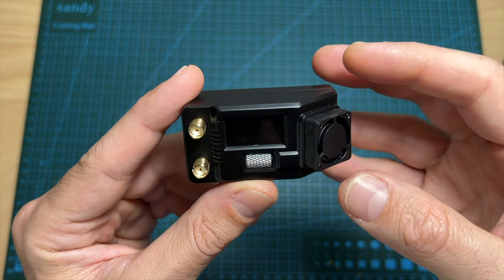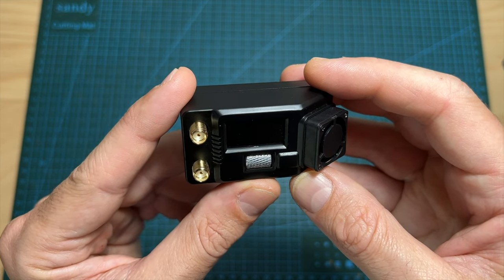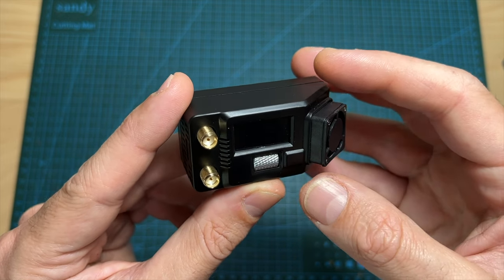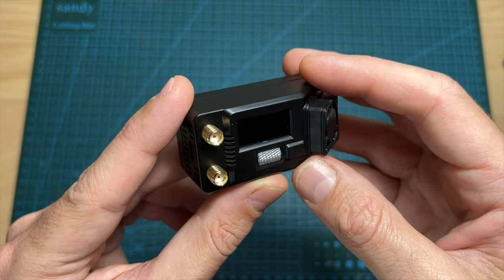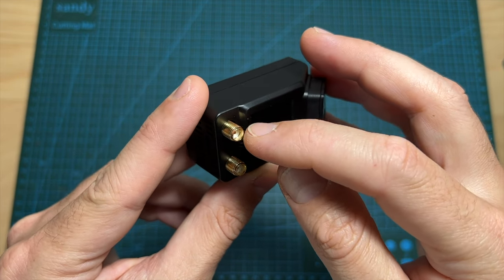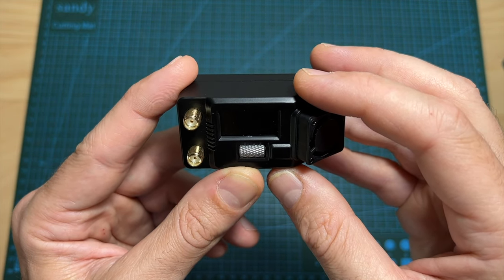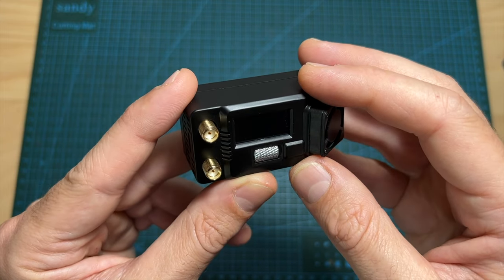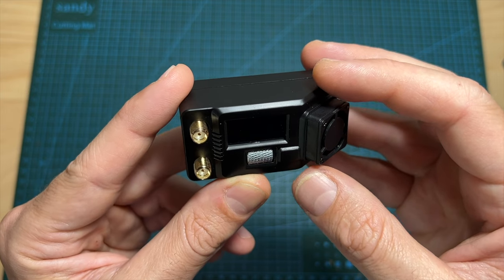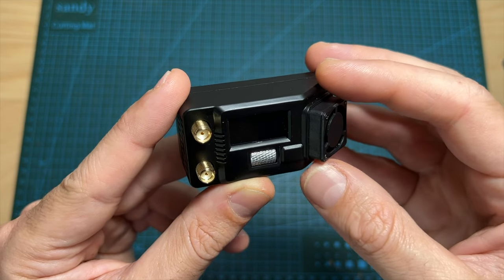In terms of features and specs, first of all, the main highlight of this video receiver is that it is intended to fix the problem that many users reported with the previous version of the SteadyView receiver, where they experienced a rolling screen, which is a result of the merging mechanism, which takes two signals like the RapidFIRE video receiver and merges them into one in order to improve the video quality. So SkyZone improved the hardware of the SteadyView receiver, and now this issue is resolved.